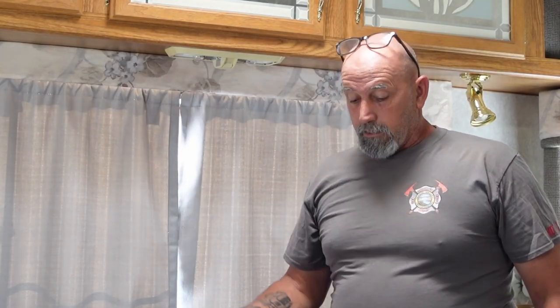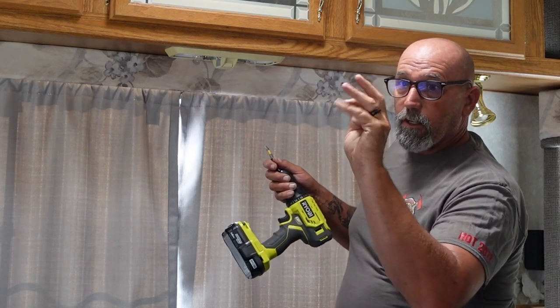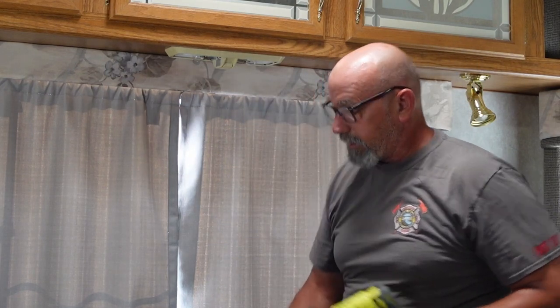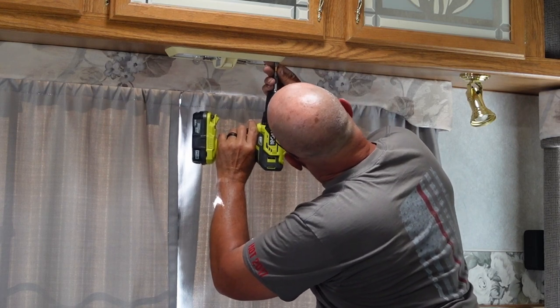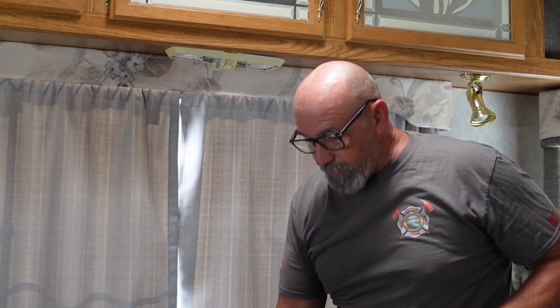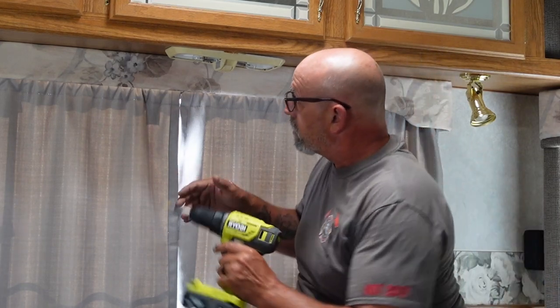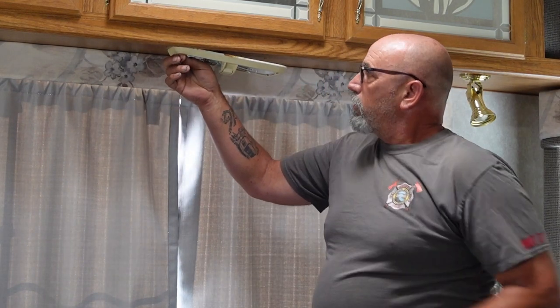These are really easy — just pinch and pull. The power is on; we're working with DC 12-volt low voltage, so we're gonna be safe, but you can do it live. No metal on me — hands have a silicone band. You don't need a fancy wire crimper; check the link below for the one I'm using, or go to the auto parts store and get a less expensive one — as long as you get the proper crimp, you're good.